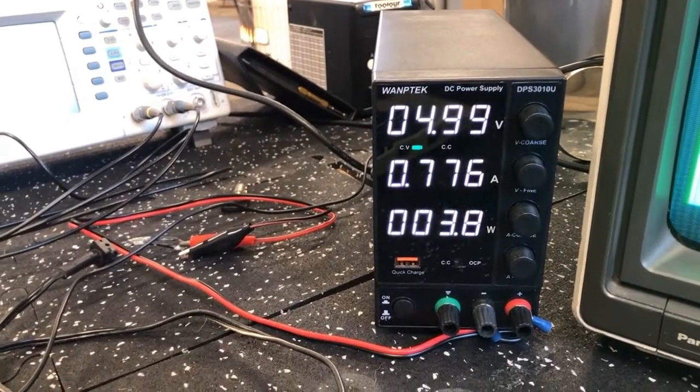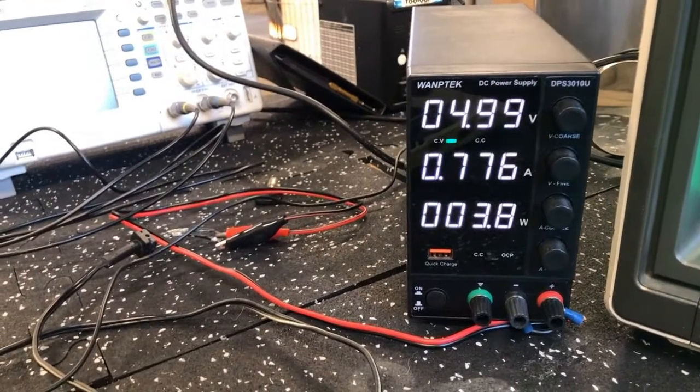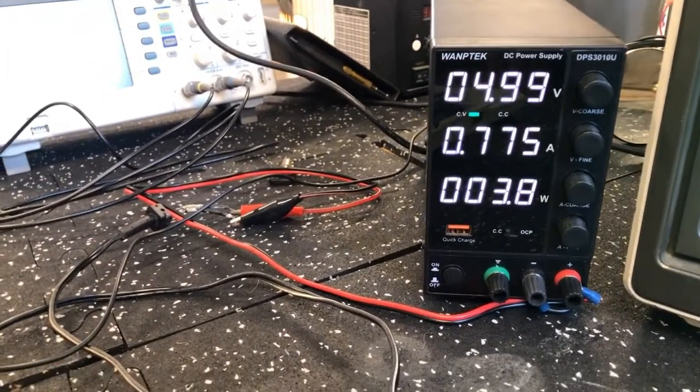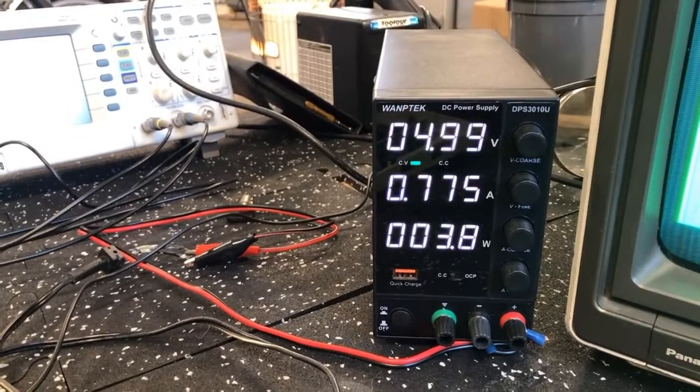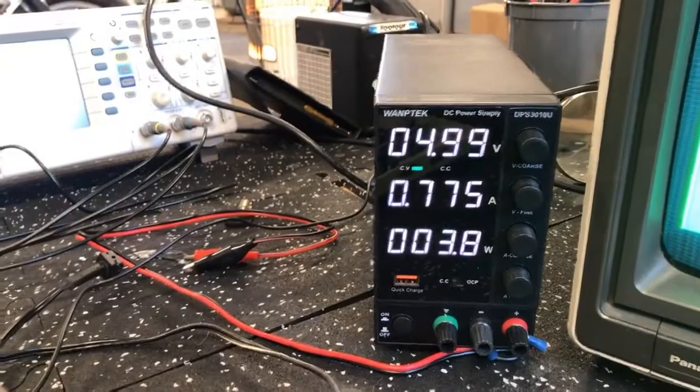All this board needs is five volts — it's only pulling 0.7 amps right now, and if it was really busy it might get close to one amp. I'll get a nice wall wart with about one and a half amps output to make sure it can handle the load. That's all it'll need. Sometimes you just don't go down the right rabbit hole — it's best if you don't go down one at all. At least I got a working Atari now! Hopefully you guys had a good holiday, and I'll see you soon — I've got something else in the mix. Catch you later.